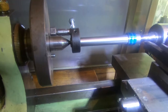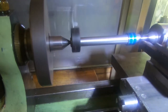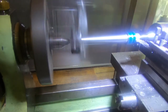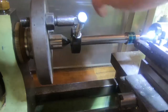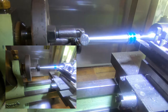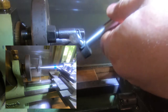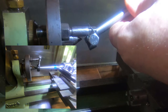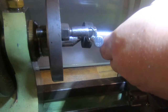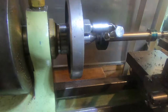We're aiming for 10.82mm here — that's where we need to be. I think this is about 12mm now so I'm going to clean it up. Just before we go any further — push-on fit — we've kind of gone too far. However it looks like it's going to be about two or three taps, fraction loose, but a bit of Loctite will fix that. That looks like it's going to work, so we're going to call that one done.